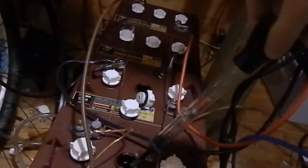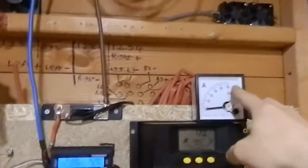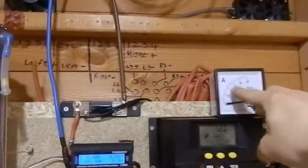So all that's left to do is to disconnect the 12 volt battery, because before they were all in parallel, and just those two wires hanging down there will be for the 24 volt system, and the 12 volt battery will be disconnected. And now instead of shooting up to 50 amps in the summer, we only get 25 maximum, but at twice the voltage. So I hope you found that interesting, and thanks for watching.